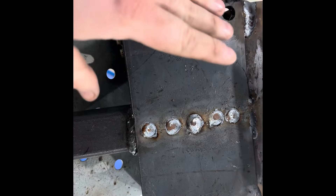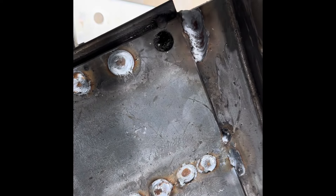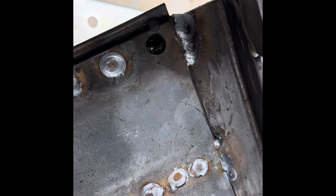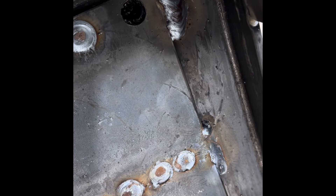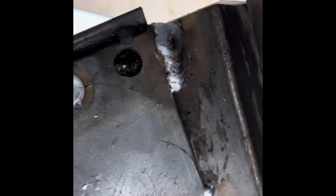There's absolutely nothing more satisfying than doing plug welds — I don't know what it is about them, they're so much fun. I did have to do a little cover pass on this one; I wasn't happy with the first pass because it had a little bit of porosity. I think it's because of the angle I was holding the gun — the argon was getting blown out of the way or being blocked from getting to the part. I had the gun at a huge angle and the argon was not protecting the weld like it should.